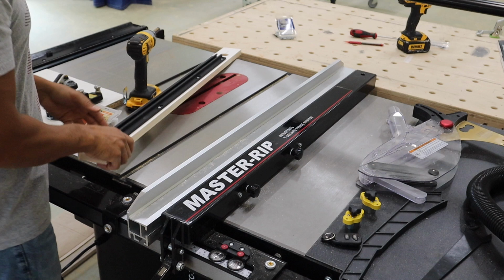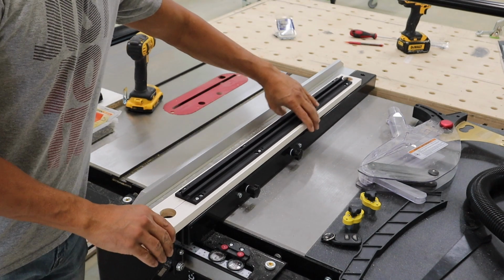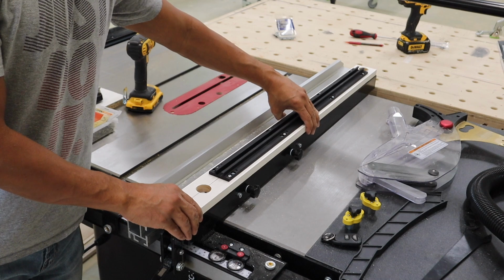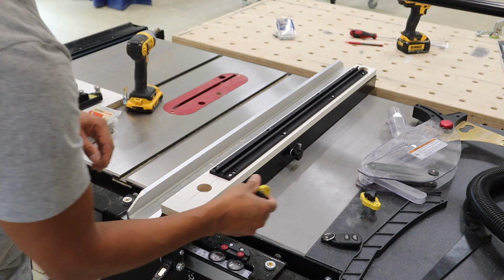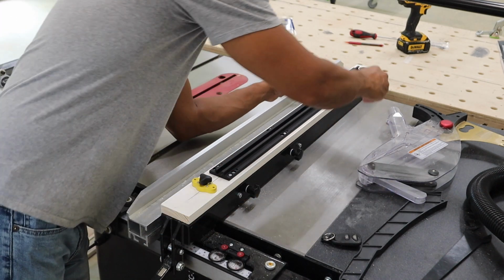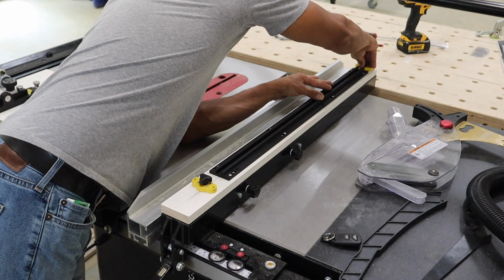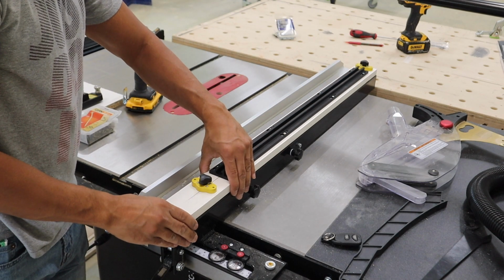Okay, now we're getting somewhere. This is the front that I marked with an F. Now we're going to position this right here, table saw on the fence, and I'm going to line it up, and then I'm going to drop in my Magswitch magnets on both ends. I'm not going to screw them in yet because the first thing I want to do is to actually get it in place of where I want this thing.